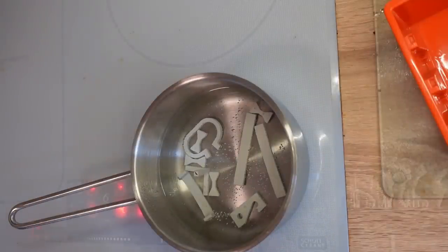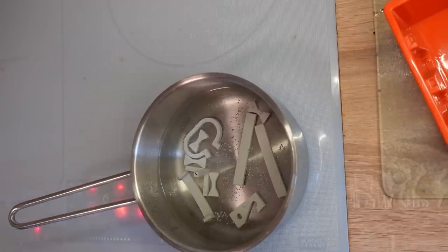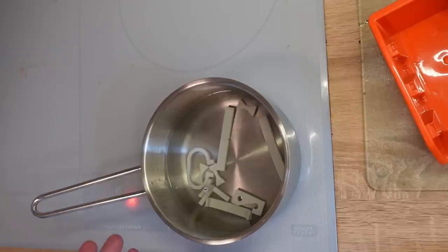This is now the stabilized state. You can see it is not completely boiling water - it is near boiling, 96 degrees Celsius. But this is far enough for the annealing. I don't want these objects to jump around or deform even more. After 45 minutes the water heating automatically turns off, and I will leave it to cool down. Then I will analyze the objects.